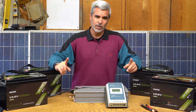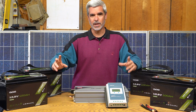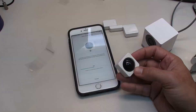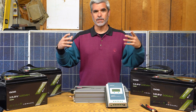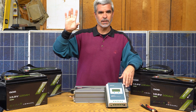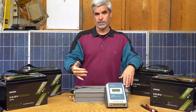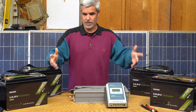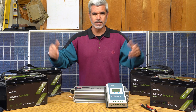So I've gathered some parts here. If you want to watch me put together a system so when the power goes out you can have your fridge and your freezer and internet and the basic things working in your home, don't go away. The basic functionality I'm looking for is that when the power goes out, the circuits in my kitchen — basically just the lights, the fridge, the freezer in the garage, and the internet — stay alive. That's only a few hundred watts. A fridge is honestly 150 to 200 watts, so I need maybe 1,000 to 1,500 watts max for those critical loads.